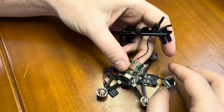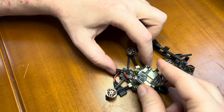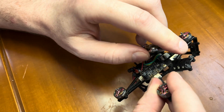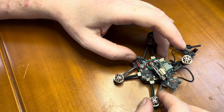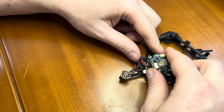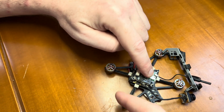Now that we have it connected, I think I will put the heatsink underneath. I used a plastic standoff here because, as you can see, the ExpressLRS antenna is here and I don't want the heatsink of the Thinker to damage the antenna. That's why I had to use standoffs on all four ends. And you can see it can fit directly.